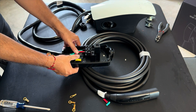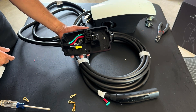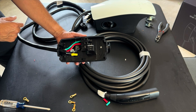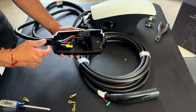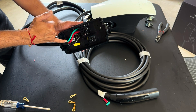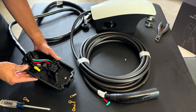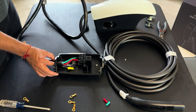The wires are now connected. As mentioned, these are 6-gauge wires for the NEMA 14-50 plug; a direct wall connection for 48 amps on a 60-amp breaker would use even thicker 4-gauge wire. I ended up cutting the white wire a bit shorter so it wasn't in the way, and trimmed the sheathing to get the green and red in. You could cut them at different lengths to make it easier. They're all in tight and the wiring is done. After the fact I'll add something to hold the wire in place so it's not tugging on the connection.